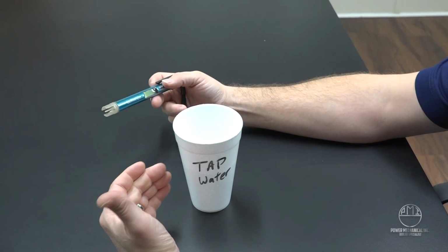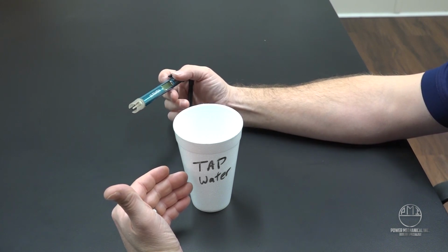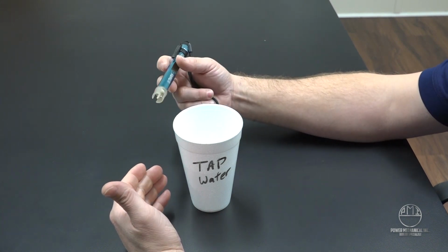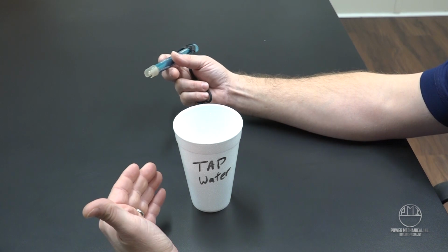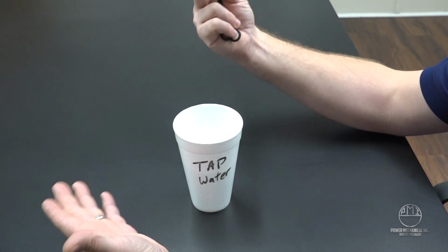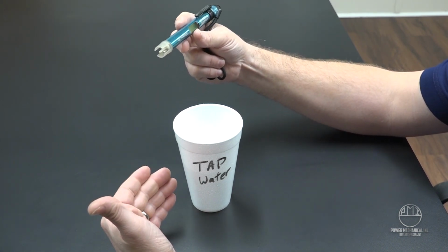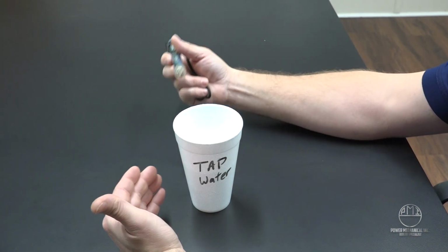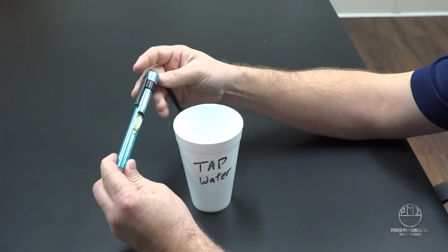And secondly, as we talk about temperature, if you don't have a sample port on your boiler, then the water you take to test is coming out at 212 degrees or just slightly under, and you don't want to plunge these sensors down in there because you'll, what I call, smoke the tip. So with that being said, you want to let your sample cool off some if you don't have a sample cooler.